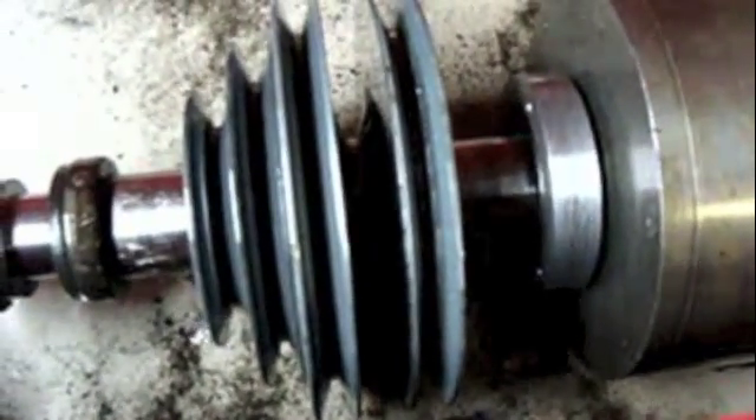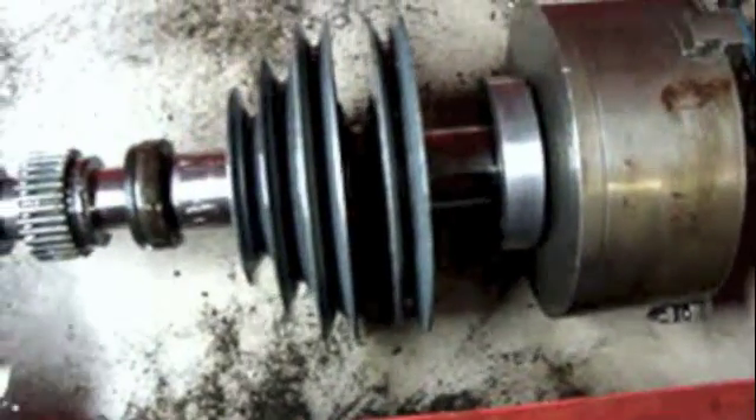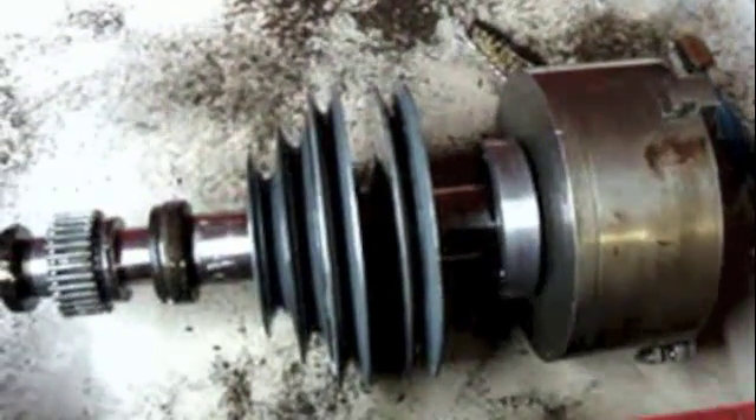The amount of grease — or rather oil and dirt — that was down inside these pulleys and saturated into those belts is just amazing to me. This thing was actually still running; you would think those belts would be slipping badly. This is the pulley that slides back and forth. This is called a compound drive, and there's a way to work with these pulleys to create a situation almost like having back gears, so it'll run really slow.